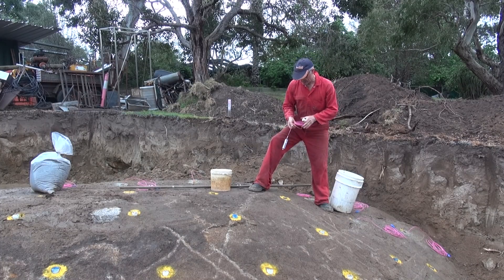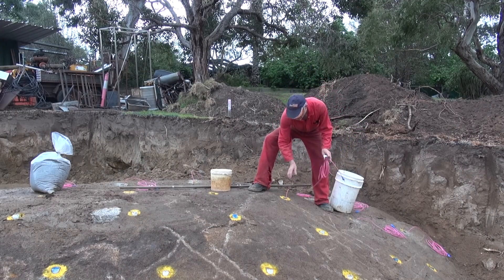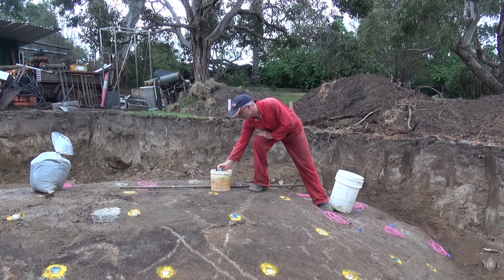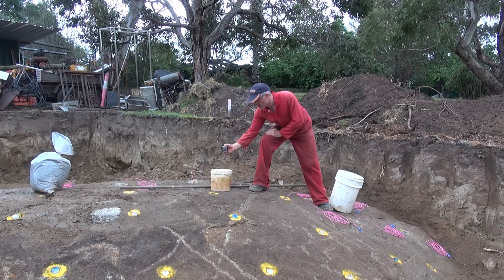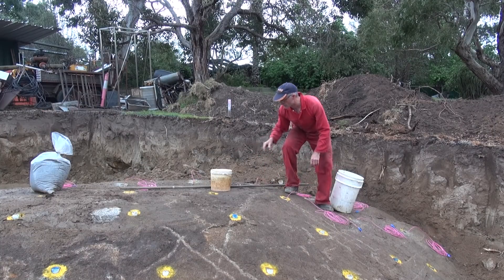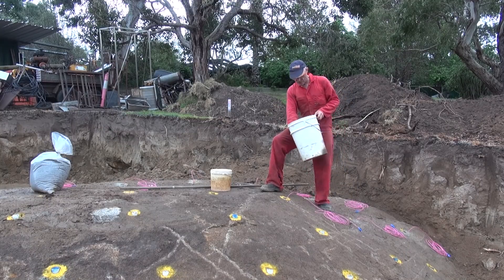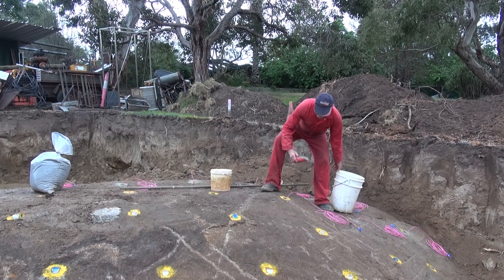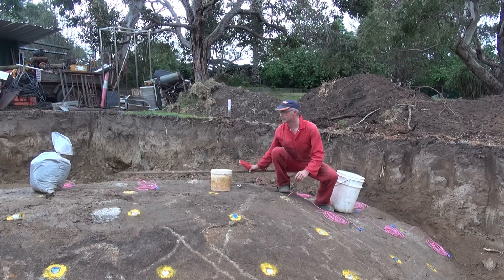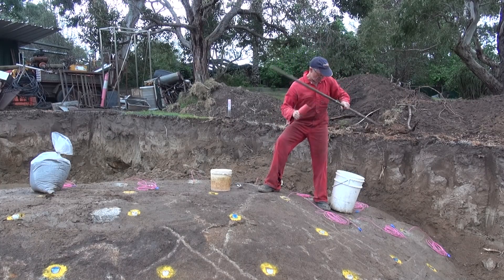The design of this shot is such that each hole shifts about half a cubic meter of rock. They're primed with half a plug of 25 mil jelly, with about that much ANFO, which is equivalent to about 100 grams of emulsion — so it's about 150 grams per hole, which brings us out to around 300 grams per cubic meter, which will very well smash this up.